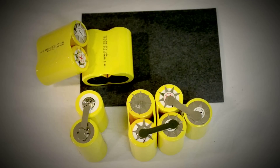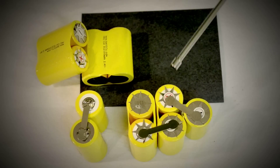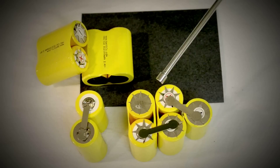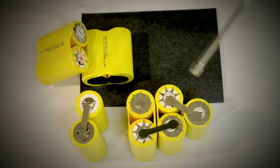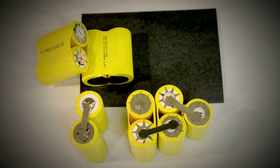That page spells out exactly what the kit includes. Let me show you how easy it is to connect our product with no heat and no solder, yet a foolproof 100% mechanical connection. When you receive your battery rebuild kit, the batteries will come both singly and in pairs, marked positive and negative. All connections should be made positive to negative. The temporary stickers should be peeled off so the battery looks as so. A nickel barbell should be placed between the positive and negative, centered on the star, and the arms folded for a foolproof mechanical connection.